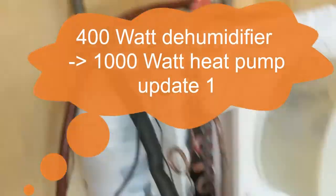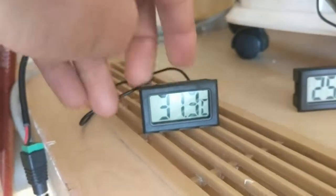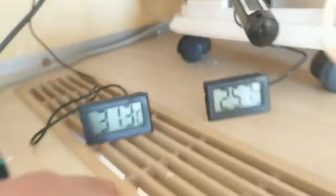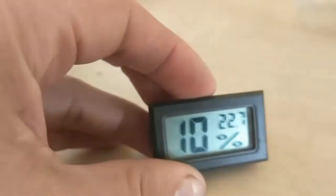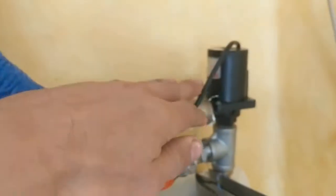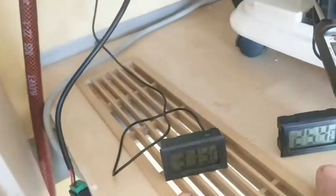First update on the setup: it's really working now. 31 degrees coming from the roof, 25 going out, and the roof temperature is 22. So this is really warm water coming from the roof. Maybe the pump last time was not working because of some air up there, and so I think that was why the temperature going in and out was really quite the same.